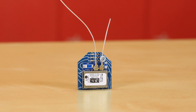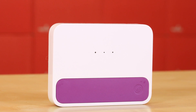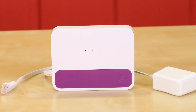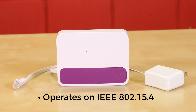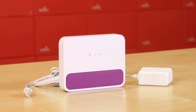Speaking of which, let's take a look at the element access point now. The element Ethernet access point is the bridge between the Atom modules and your preferred cloud platform. Each element connects to the Helium routing infrastructure over Ethernet while data is securely routed to any cloud platform of your choice. It too operates on the IEEE 802.15.4 networking standards with the same wireless connectivity as the Atom, and has a typical operating range of 4,500 square feet or several miles within line of sight.